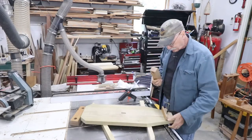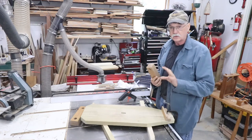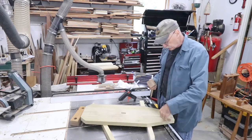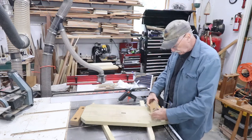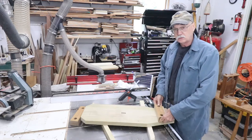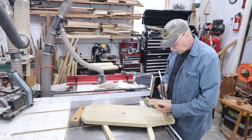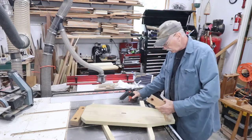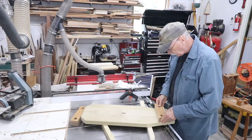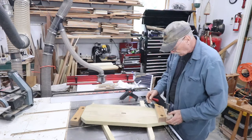A little change of plan: I'm going to use hot glue to hold the cleats in place, which will hold them very nicely for drilling since I'm only putting downward pressure with the drill. I put a stop block here for exactly where this one has to go and can line it up before the glue sets. A few dabs from the hot glue gun — as you know you can knock this stuff off with a hammer later. Hold that for a little bit.